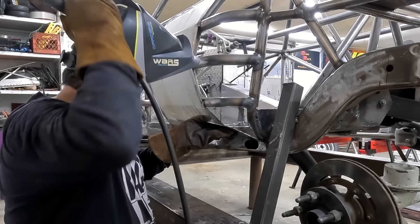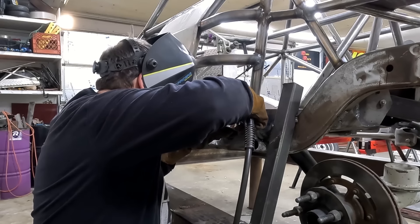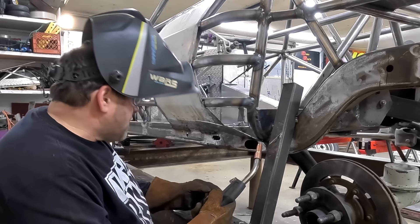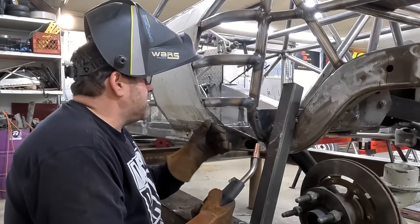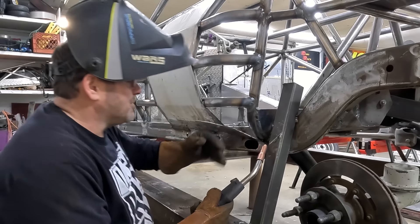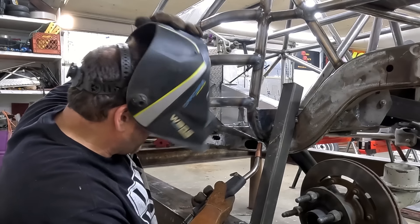Now I'm in there and I'll say, okay, I want this side to come right up through here and this side to go right up through there. So I'm just kind of getting a rough idea and then I'm going to trim back. There's a lot of stuff you can do like this — like a weird piece of aluminum you're trying to figure out how to get shaped to fit somewhere. So now that's in there. This side looks good. I got about a half-inch overlap. I'm running up that bar, and then I'm going to go to the bottom of that tube all the way around. I don't want too many welds — I want enough so they don't break off where it forces the steel to pin. Find that happy medium.